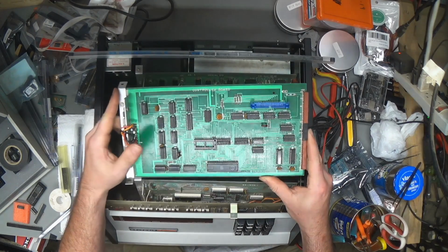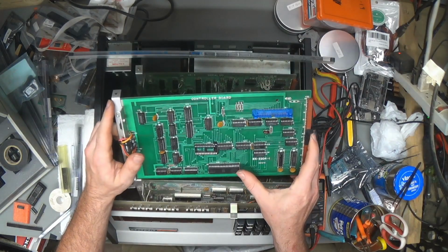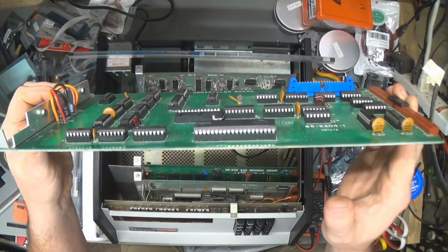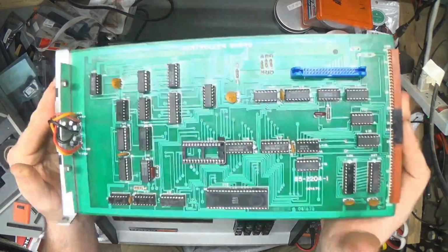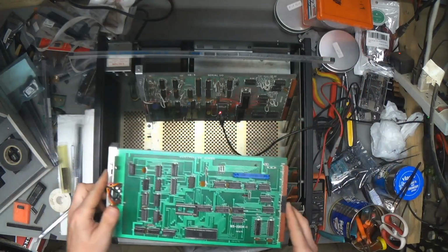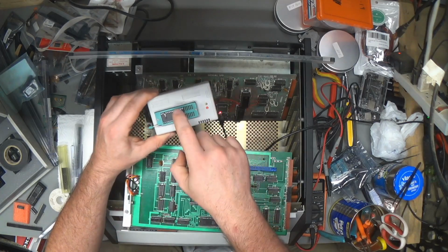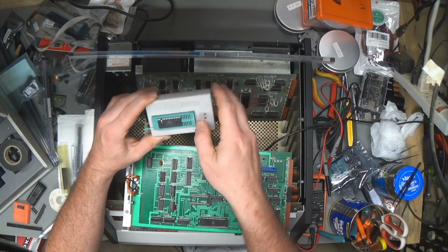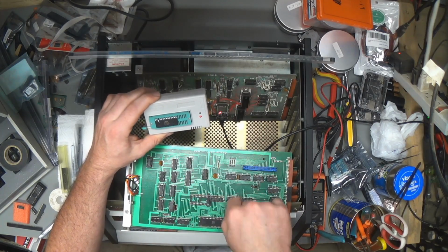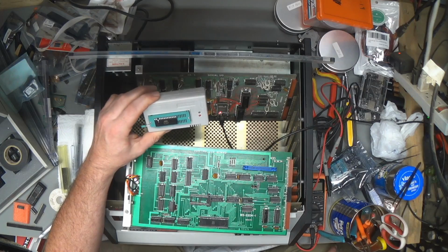I populated the rest of that stuff on the board, and I modified a 28-pin RAM socket to convert the socket over to use a 28C64. So what I'll have to do is concatenate 4 copies of the ROM together and then burn that to this thing. I've got all the unused address lines tied to plus 5 volts because it was the easiest way to do it, so it'll access the top area of the ROM all the time. So that should be fine.